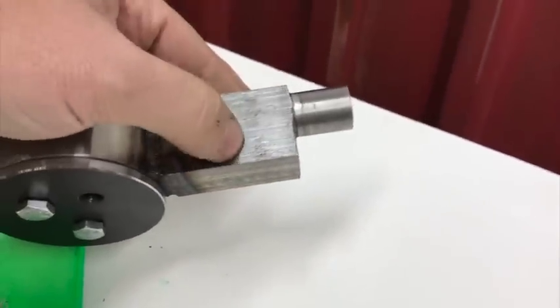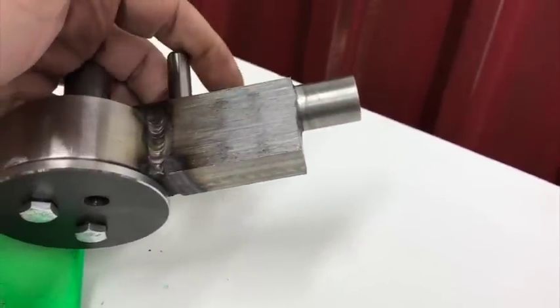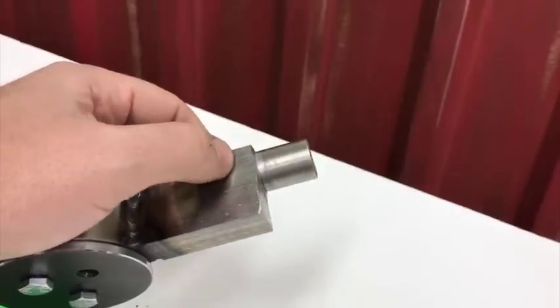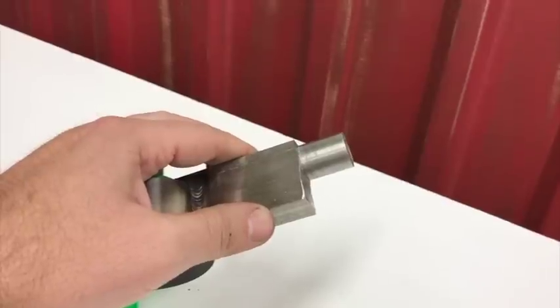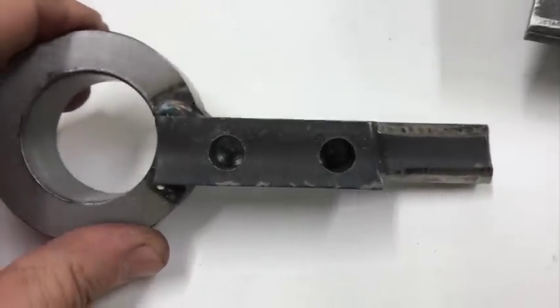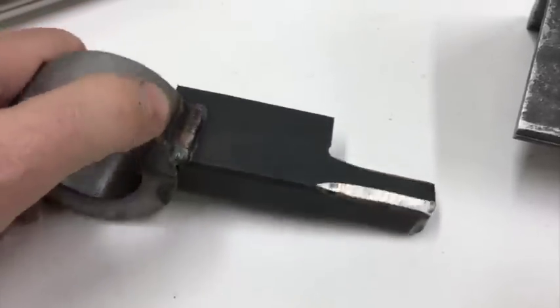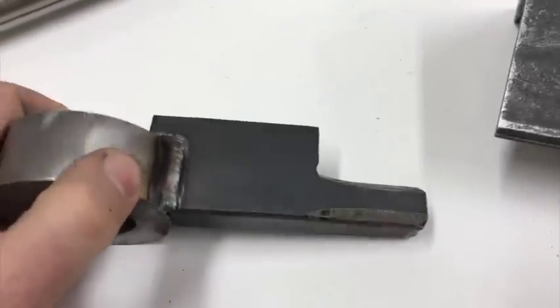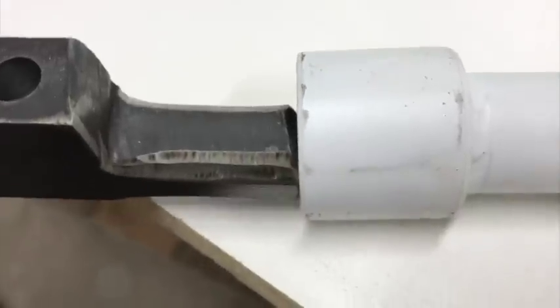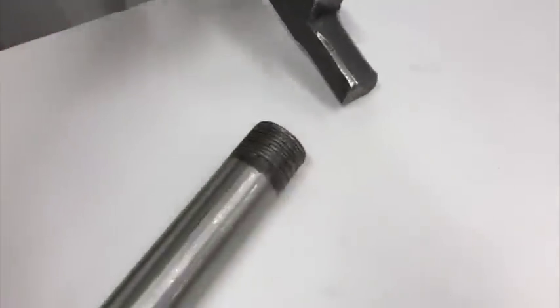Here's the one I made to make the instructional video with. On the original one, this flat part is a milled part - milled on a couple of different surfaces, then put in the four jaw chuck, indicated, and the round was turned on it. Tom Lipton's original design actually had you putting a hole in this and inserting a pin, but I thought a one-piece design would end up being stronger and you wouldn't have to worry about the pin coming out. I cut this out on the plasma table - it's not exactly an even cut, but with a little bit of work on a grinder you can clean it up pretty nicely.